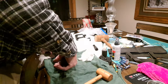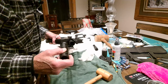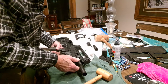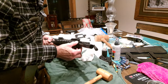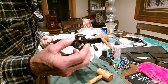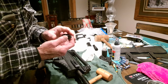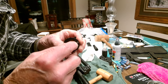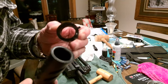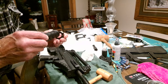Move this guard that also holds in the top guard. Inside of that is a piece that has a set screw sticking out that aligns with the hole in the bottom, and there's also a little ball bearing that points out and goes against the ribs on this retaining ring.